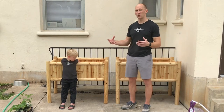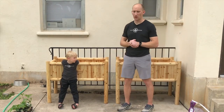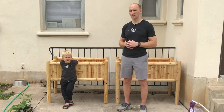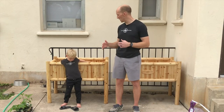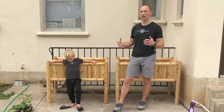These are the two options I usually recommend: tung oil or shellac. Both are considered food safe. Shellac comes from the shellac bug and is also considered food safe. If food safety doesn't matter to you — if you're using the planter for flowers or it's just not a concern — then we'd recommend something like a deck sealer, like Thompson's Water Seal. That will give you great results and extend the life of your planter. The most important thing is to apply it more than once — at least every year, if not more often, depending on your climate.